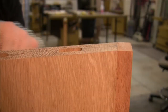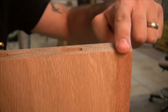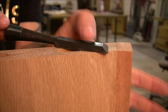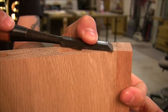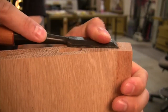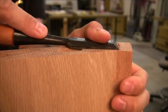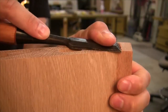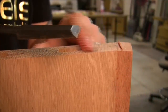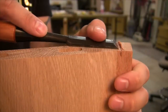Okay, now there is a 10 degree slope toward you. And of course, this is 10 degrees down, but here's where our offending material is. You can see that by me using my thumb to hold this down on the surface. And as I scrape it across, once I get to the point where that wood is, I do a back and forth, a little bit of a sawing, slicing action as I push forward. You can see the material I'm starting to remove. Because I'm referencing off of this flat surface, that lets me know that's the stuff that I need to get out of here.